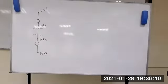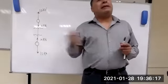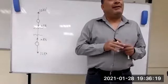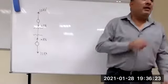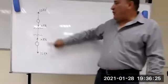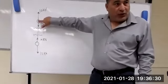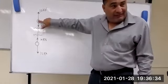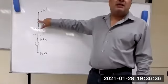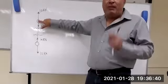Internal force now. All the truss's concern is the internal forces. Internal forces, compression or tension? Compression is wrong. Put your finger on the joint. If the force is pulling your finger, you have tension. Same thing, if the force compresses your finger, you have compression.